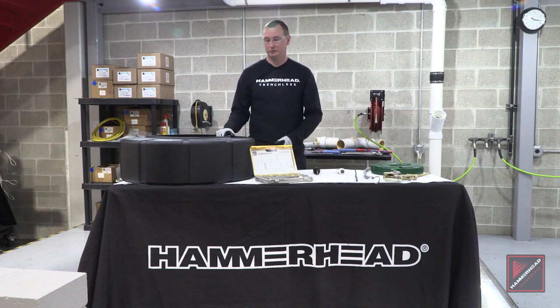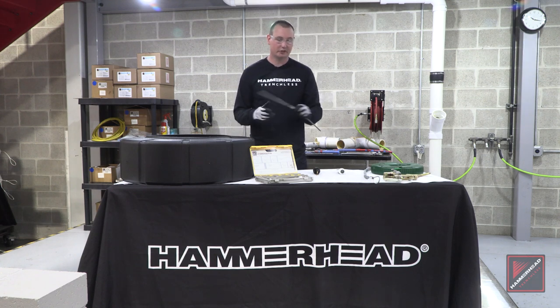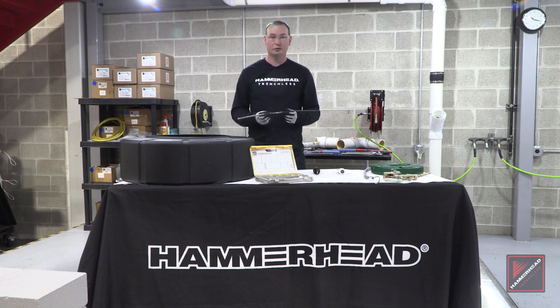First thing we want to touch on in the kit is the cable. The cable is a swaging compacted cable with two different diameter cables. The first diameter is a quarter inch, which is only used to pull the cable through the lead service — you never want to attach the quarter inch cable to whatever you're using to pull. The second half is what you want to pull on; this is a three-eighths diameter cable. It has better break strength, it's smooth on the outside, and pushes easily through the lead. These two cables are brazed and joined in the middle, which is why we do not want to pull on the quarter inch cable — this is the joint that will let go. Always pull on the three-eighths end.